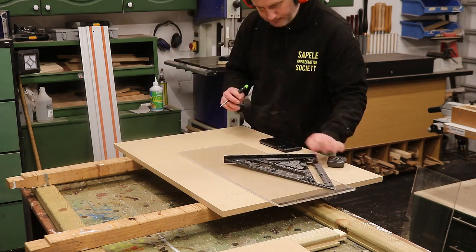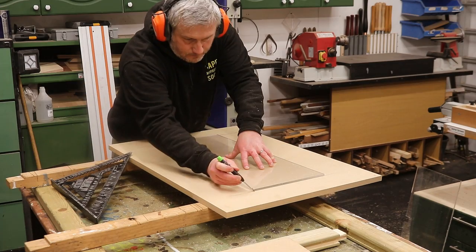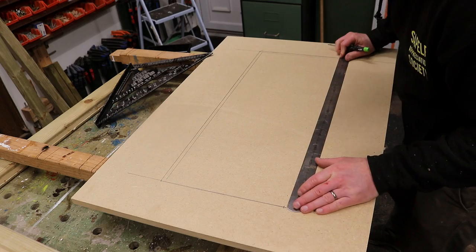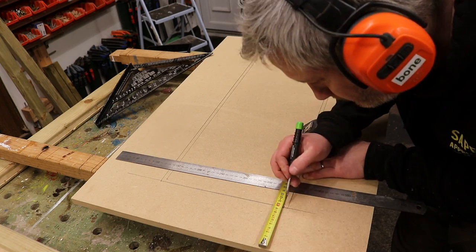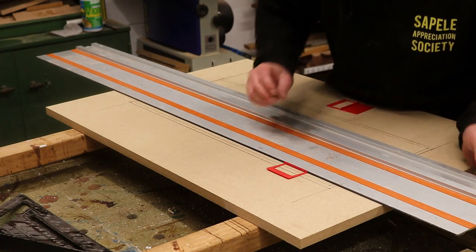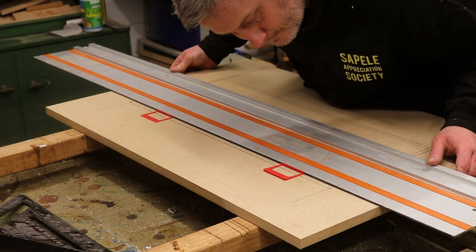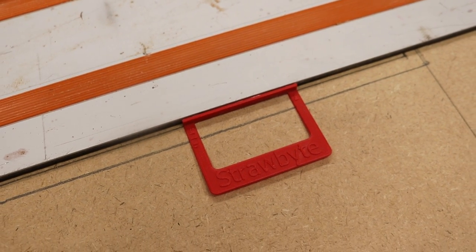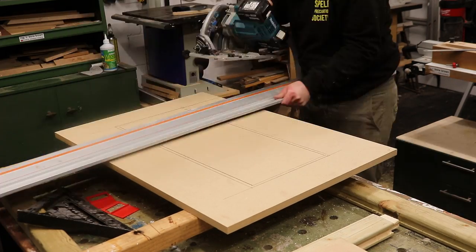Then I can mark around it to give me the shape I'll need for the opening. I realised here that it would have made more sense to cut the opening first and then cut the window to size, but hopefully I can still achieve a nice fit. I want my opening to be 9mm smaller than the plexiglass, so I'm carefully marking up an offset here, and then I can use the track saw to cut the opening. The Strawbite Workshop waste-side jigs are ideal for this kind of application for absolute precision — they show you exactly where the cut line will be when you want to cut on the waste side of the line.